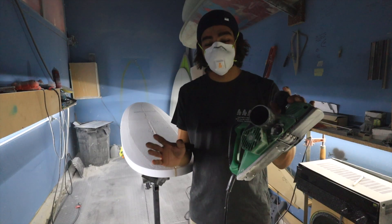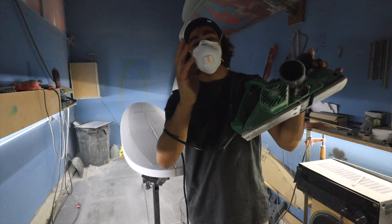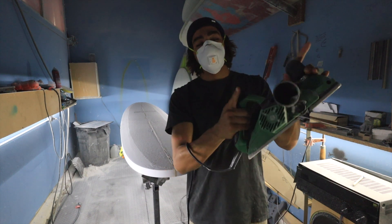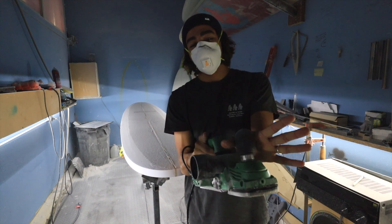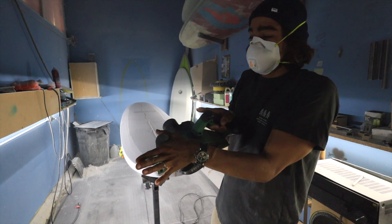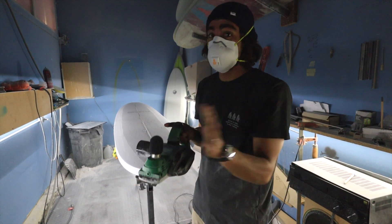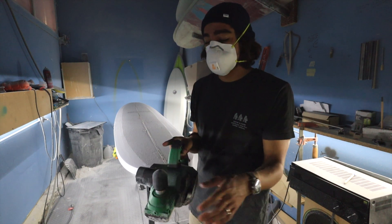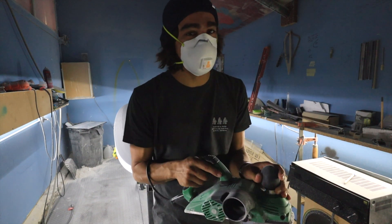Just as a reminder, when you hold your planer, you want to wrap your arm around the cable, grab the planer with one finger apart, and I like to get my hand on the knob like this and then tighten it around there so that you're not overextending your wrist, which will make it sore after a while. Get it somewhere comfortable because you're going to be holding this thing for a while.